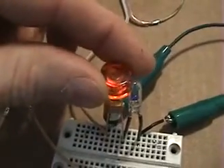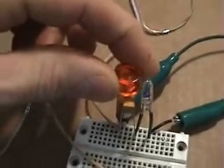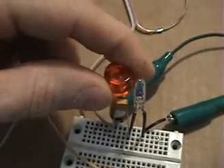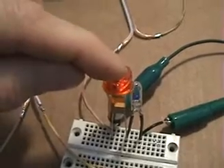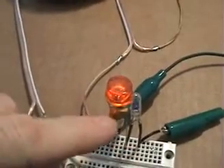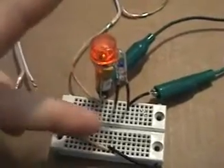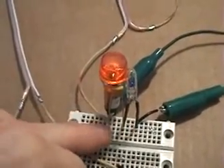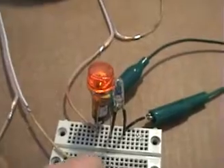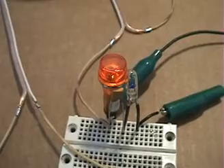In tutorial number three I forgot to mention I did not use the neon bulb, because when you're using the capacitor in parallel, even when you hit resonance, I have not seen the neon bulb go bright the way it does when using a capacitor in series with square wave. It seems to be more intensive using square wave with the capacitor in series than using sine wave with a capacitor in parallel. That's why I've switched over to using only a capacitor in series and square wave.